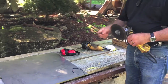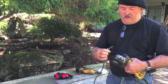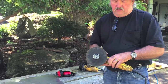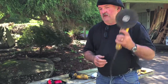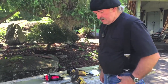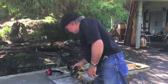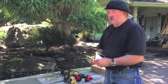Now let me warn you, I got the guard off this grinder. I do it this way but I don't recommend it — it's dangerous. You can certainly get cut with the guard off because you can see right here where my paddle switch is. If I'm not careful, I can just slide my finger right up into there, and believe me, it smarts when you do that. So I'm not suggesting you take your guard off — that's going to be totally up to you. I do it simply because the guard won't fit with this big a disc on here. I got the largest thin disc I could buy and my guard doesn't work with that.